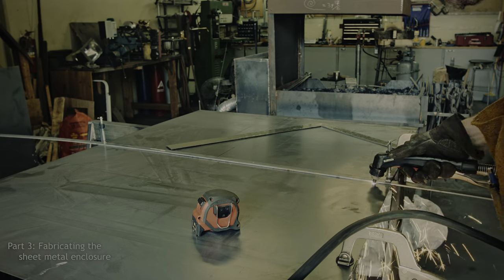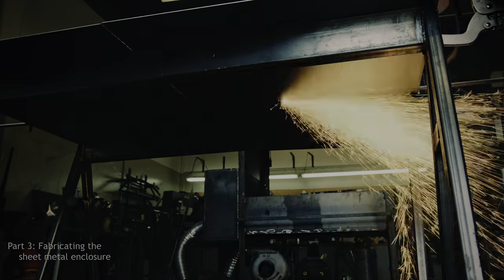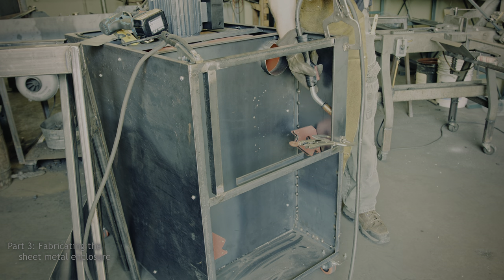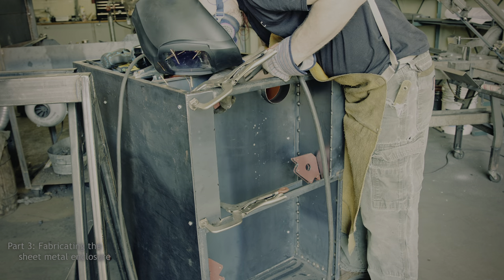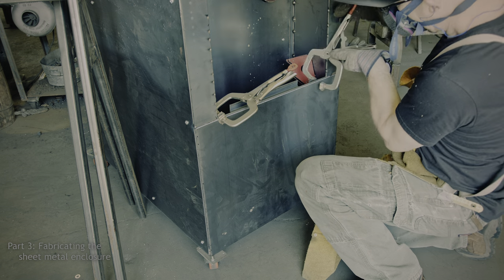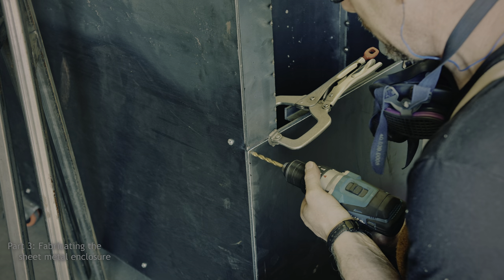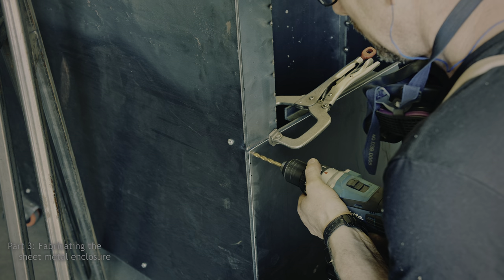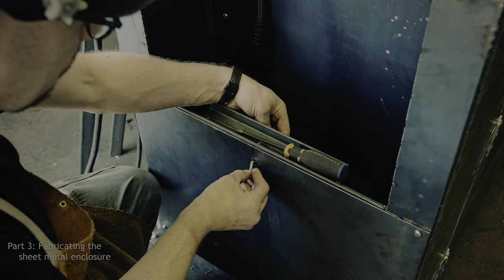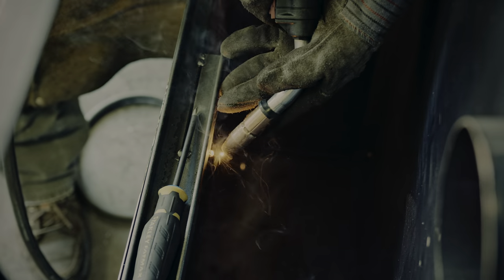The only work remaining is really just to close everything up. You can actually tell by the interruption in the plasma stream where I am not fully cutting through the 16 gauge thick sheet metal, but for this particular project that's all okay. In terms of safety, I am using a low profile mask to filter out fine particles from the air I am breathing. When I recorded this video in California, we had fires all over the place and the general air around where I live was not healthy to breathe either. As before, I tack weld a nut in the back and that's it. There was one challenge though — I needed a screw to hold the cover in place right underneath the filter box and I could not quite reach that with the welder, so I need a little help.